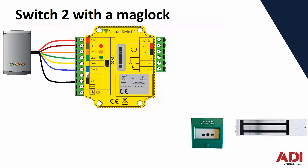Let's add the devices in question — first the magnet and the break glass unit. I'm using double pole to be compliant with most fire regulations, so you've got to cut both sides of the power, both negative and positive. That way you ensure that when you press the green escape button you definitely cut both poles of power to the magnet. In some cases someone could add a third party access control later and be switching negative while we're switching positive — using double pole guarantees you cut both sides.